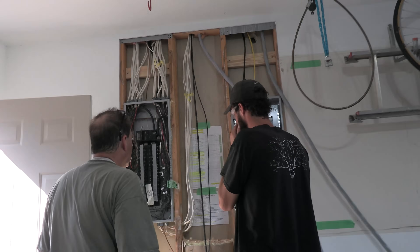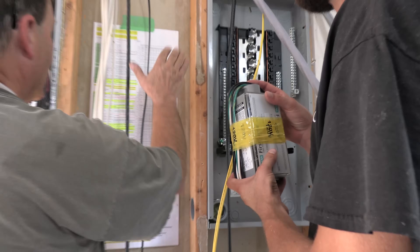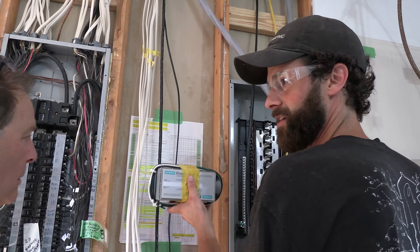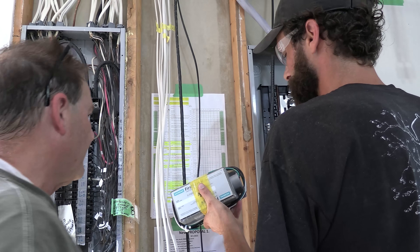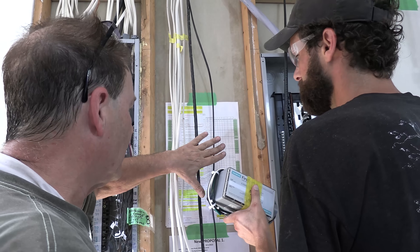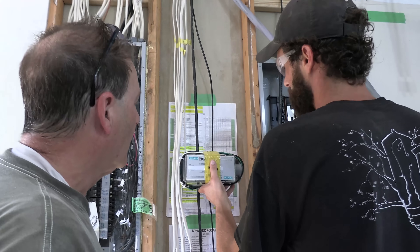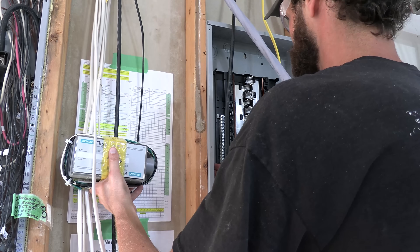Where would you like the FS100 to sit — surface of the drywall? I'm going to mount a board here. I like having it as close to the main breaker for performance as possible. Are you thinking to go ahead and slide a piece of drywall in there so that it's on the finished material? We could put a three-quarter inch offset nipple in here, mount it there, offset right into here, and terminate on the breaker. To view it, you would have to take the access cover off, which is tool-less — just put your fingertips in and pop it free.